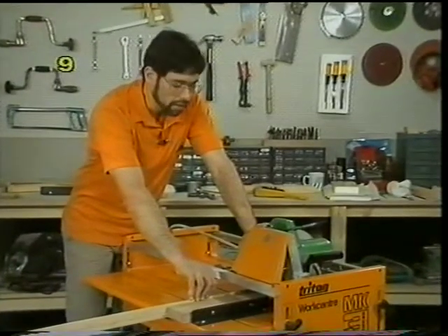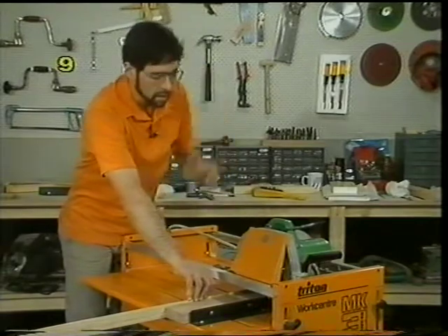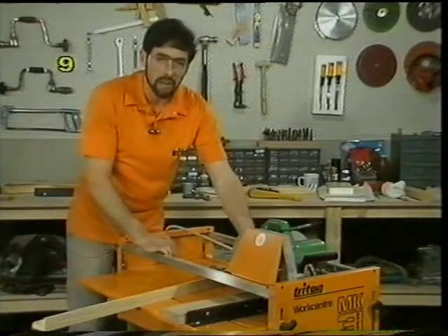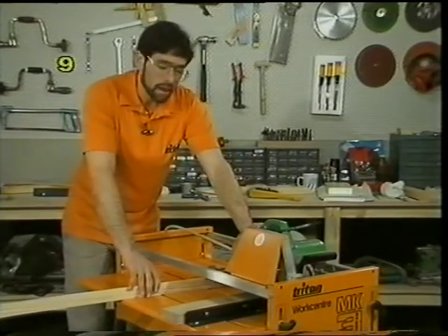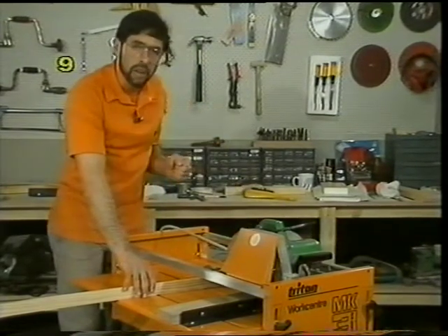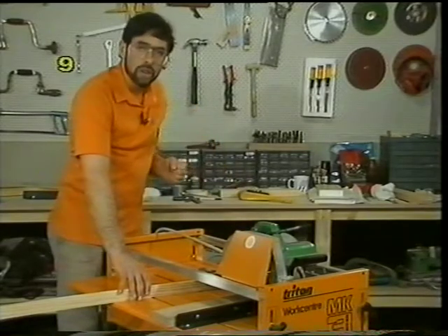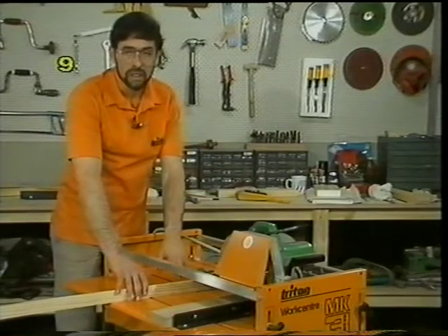A couple of very important points. Firstly, you must have a sharp saw blade, preferably tungsten carbide tipped. Secondly, the mechanism which locks your saw down must be very secure and firm — tighten the lever or wing nut very tightly. Thirdly, you must control the rate of feed of the saw, because this is a climb cut, called that way because the saw will tend to climb up on the work. Unless you're controlling it rigidly with a firm wrist and elbow, the saw will race towards you, biting off more than it can chew, and it'll damage your blade, your work, and certainly your confidence.